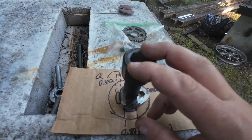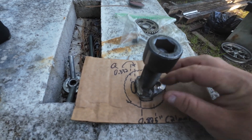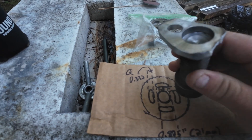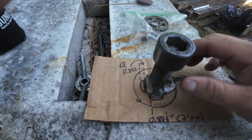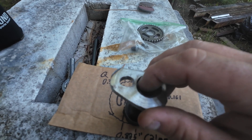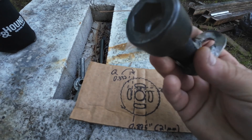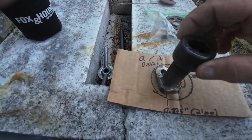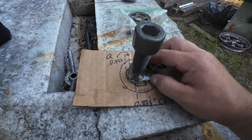This is a 22 millimeter bolt, and the reason I went with it is the steel I used is like three-sixteenths or quarter inch. I wanted to get the face deep enough so it would sit flat, so I went with a bigger bolt. After I welded it on, the area I machined into is actually into the bolt itself, so really all that's holding it together is this little bit of weld here and the bit of weld here that I haven't ground away yet. This was my second attempt — my first attempt was not very well-educated.